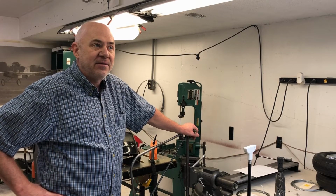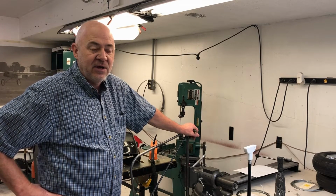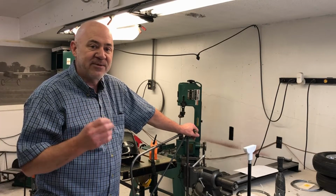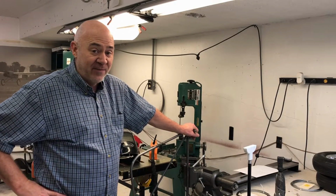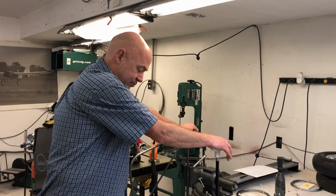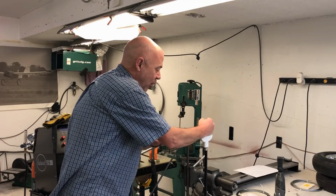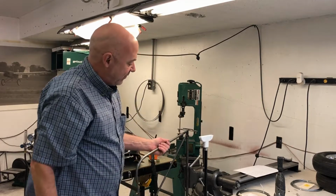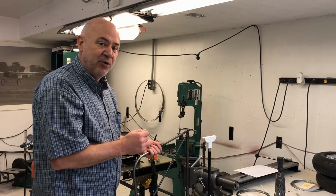that I think people don't understand that's so hard about TIG welding is how steady your hands are. Now, if you're 18 or 19 and you've got rock sharp, sniper steady hands, I don't know if you'll have a problem freehanding it. But I printed this little hand rest here, put it on a tripod, and I can set it by the part I'm going to weld, and I'm always stabilizing my hand. And it doesn't hurt to have a vise that you can twist things around while you're welding, so if you've got to get to something, you can move it.